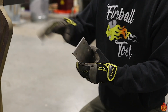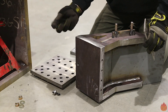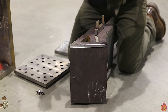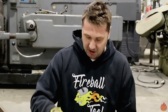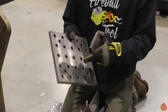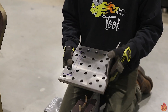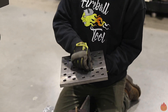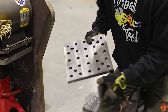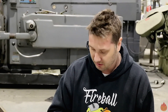We're going to copy the same thing we just did on our motor mount — it works so slick. We'll have a hand screw inside here so you can adjust the leveling or tilt of the plate. This is the same plate I use on my welding table; it's cast iron, which is going to wear really well. I also have plans to modify this plate — we're going to cut it and put a slot in it for another cool feature. After that, we'll fabricate an adjusting rod to calibrate the in-and-out motion as it slides in this slot.